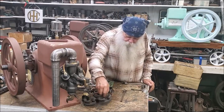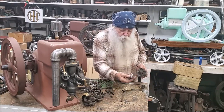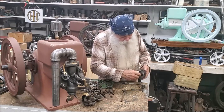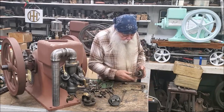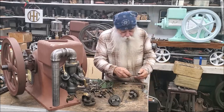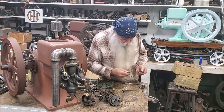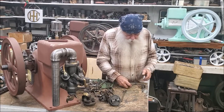You would add this part right here — it's a guide and a mounting for the governor. This one's already in there, screwed in. Once all that's screwed together, you'll have this right here. This one has the plunger mechanism — it's a pin, two plungers, both ends come off, just stuck in there with a spring and a collar.